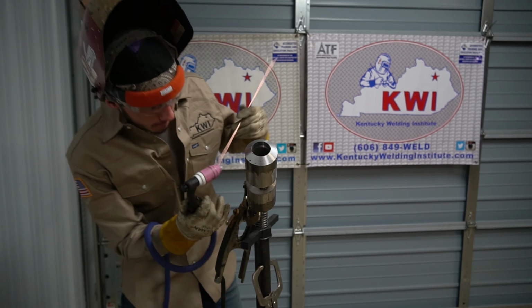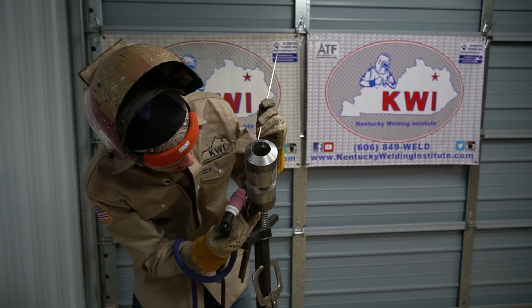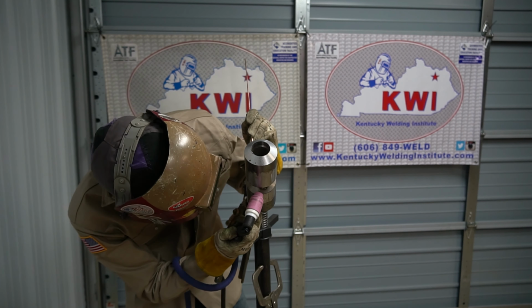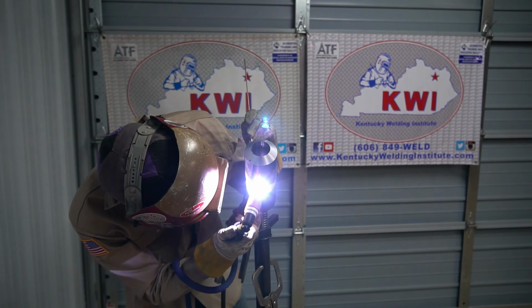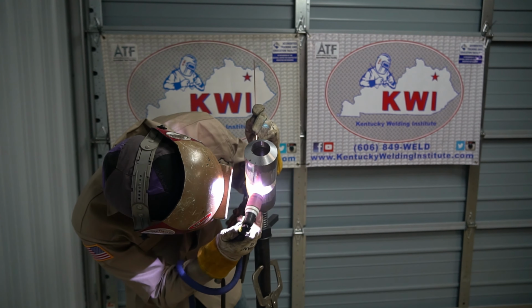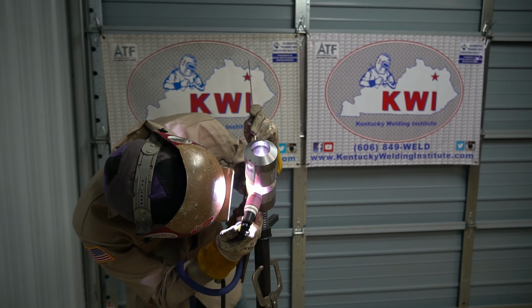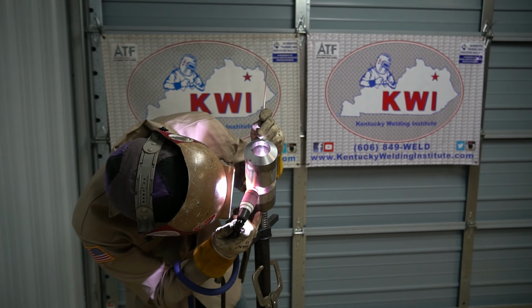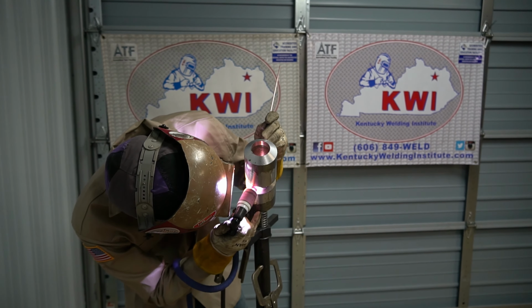And now I move over to the right-handed side of the coupon. I am a left-handed welder, so I will almost always weld the left-handed side first. That way, if the machine's too hot or my gap's a little bit bigger than what I would like, I can usually compensate for it by moving just a little bit faster.